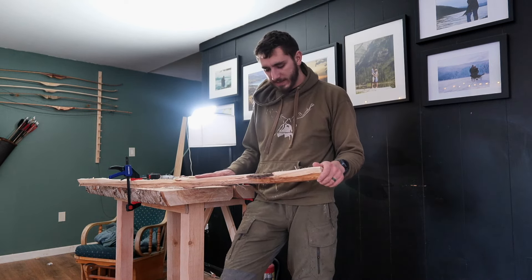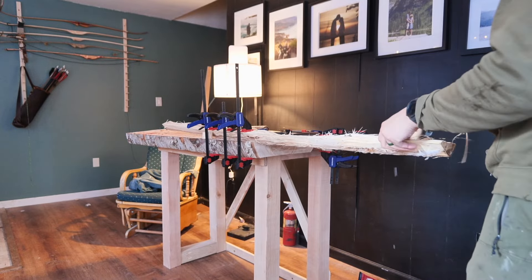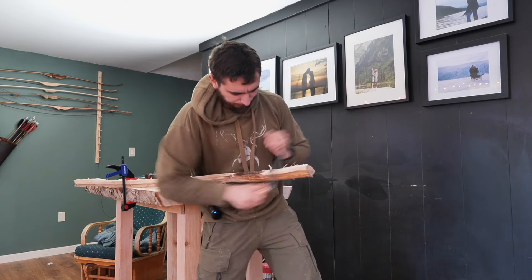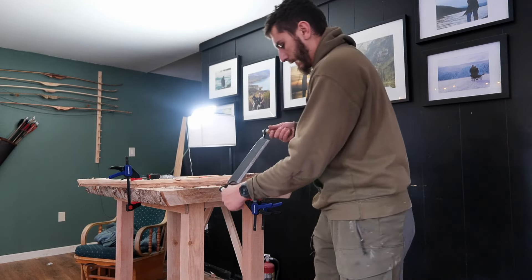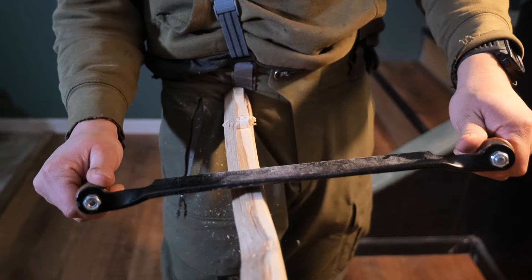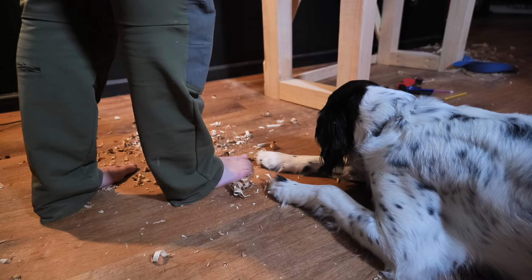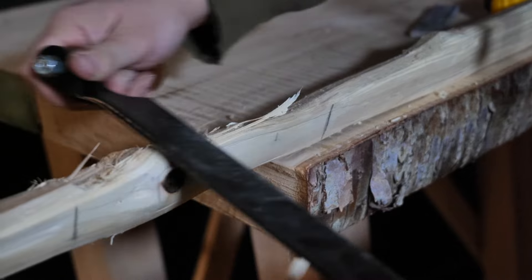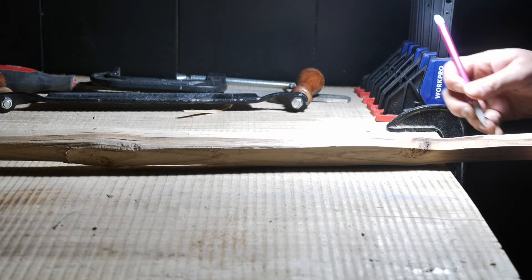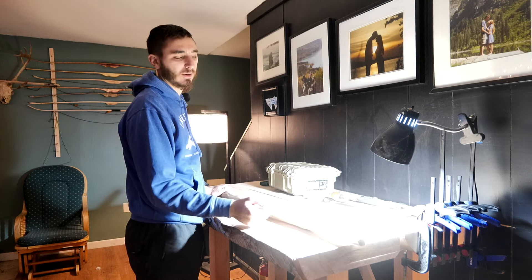What I'm doing right now is just trying to get this smooth, because as I split it there were all kinds of stringy pieces that I need to get off. I'm trying to get these weak spots that contain bark out of the wood. Then from there I'll make my layout — tracing a growth ring on the sides and ends of this bow. I'm going to go two growth rings from the beginning of the heartwood, because I'd like a light-colored back and a dark-colored belly.